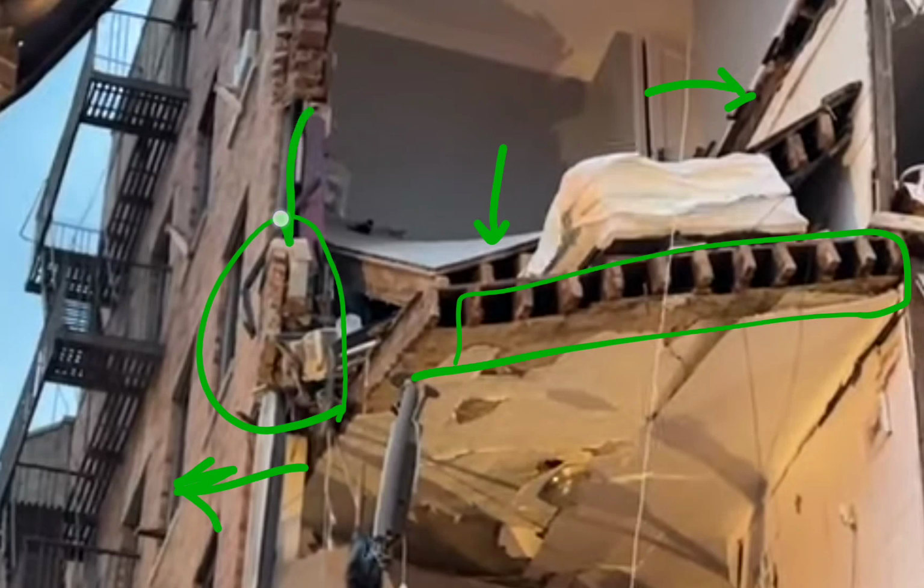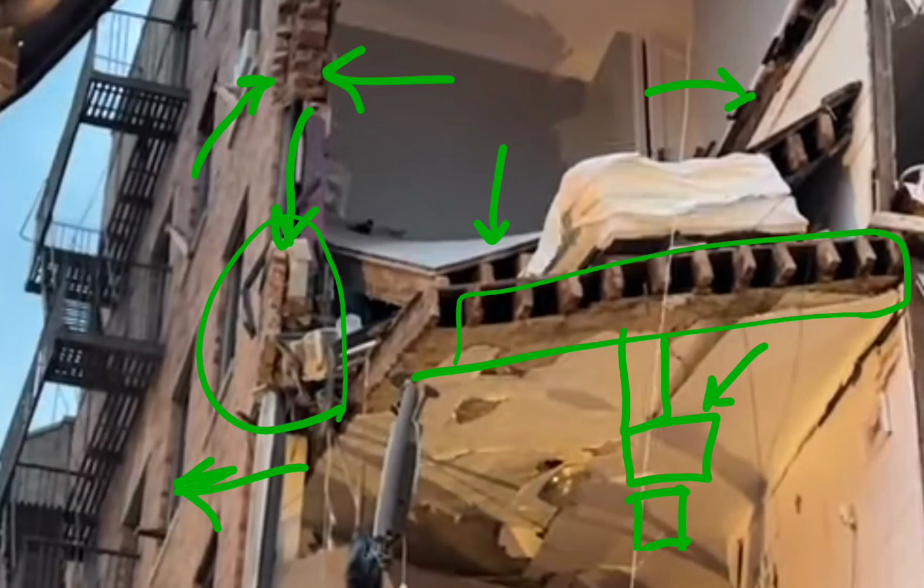I remember I said some of it's veneer. Looks like we have the one layer, the veneer decorative brick, that's the exterior, and here it is again. And then it's the structural brick, looks like it's down to, that almost looks like one brick. And tying in that facade brick would require them to tie it in with a brick that's turned the other direction. So it would be brick this way, and then every so often there will be a brick turned, depending on what they did that year and that design, every three courses, every four, every seven, to lock it in. Problem is the back brick is a non-decorative brick, so they'd have to use a decorative brick to do this so you can get that finished look outside.